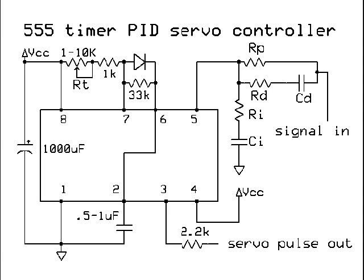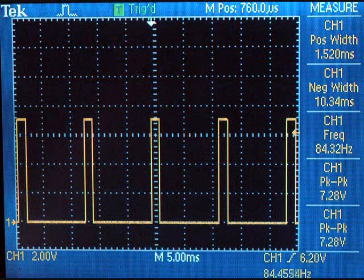RT sets the timing pulse and also acts as a set point. Because we don't actually have a set point with an op amp, RT is acting as that set point. We're using this circuit to generate the pulse train needed to control the movements of the servo, and you can see the pulse train — what it looks like right there — which is pretty typical.